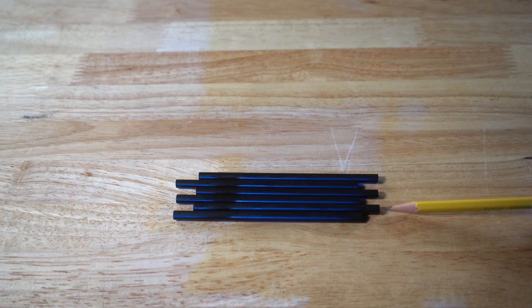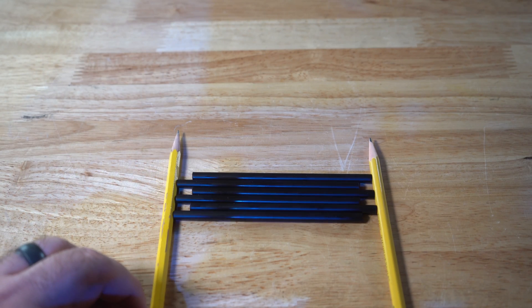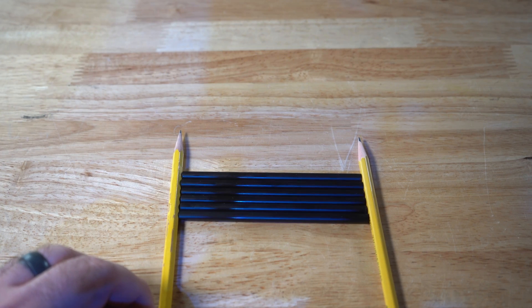If you incorporate the next line of engraving, the laser will use the same travel distance to engrave the next line. It's not like the laser is engraving less than the measurement it's supposed to. The point at which the laser fires is just set incorrectly for that speed. The machine thinks it's doing a good job because you haven't told it to do otherwise. What we're going to try to dial in is this scanning offset so you can see a better result like this.